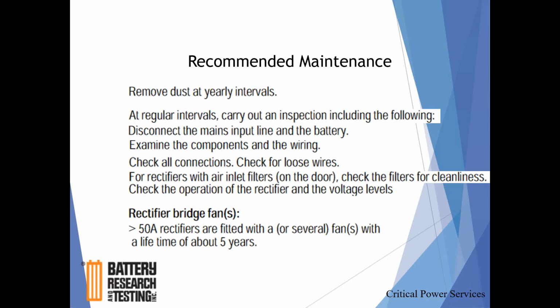If you do have loose or bad connections, or a connection or cable that is worn through to a chassis, something in that nature, it'll come up as a ground fault. You do have ground fault, depending where that is in the circuit. We do have ground fault detection on all your rectifiers.